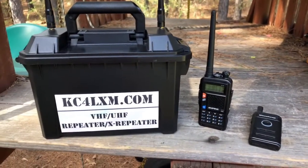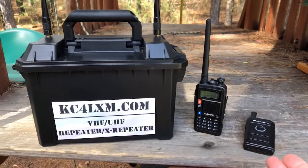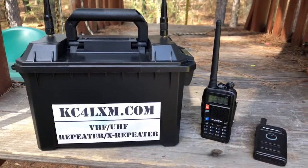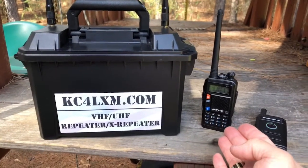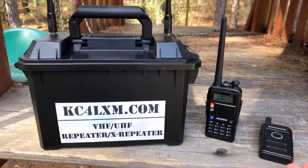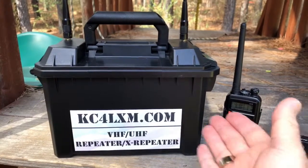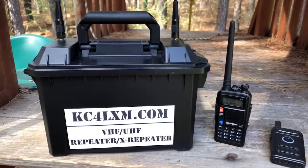So I thought it was time to do a quick field test to show you how it works. We've got the repeater here with two radios, each set up for repeater use — set up with the input of the repeater and receiving the output of the repeater. Using two different kinds of radios: this is more the type a radio amateur or commercial user like law enforcement would use, and this is more of a plain FRS family service radio, but it can also be programmed to do offsets. This one has a maximum two watt output, this one has up to four watts. Right now this one's running at two watts and this one's running at one watt. We're going to start the repeater, then get off a distance — maybe a couple hundred yards — and give it a try.